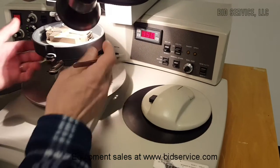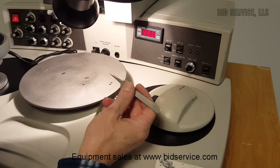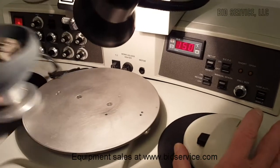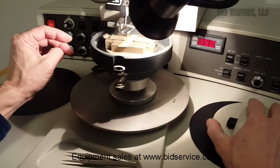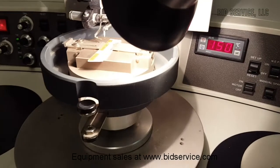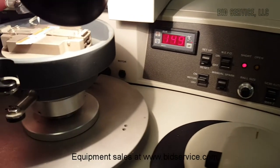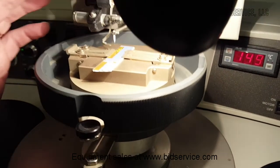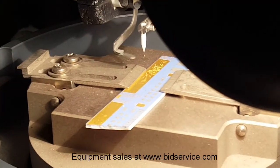I'll show you how to form a ball manually. I'm going to increase the tail size to 10 and then go ahead and do a bond. Now you can see that since the tail size is long — meaning the amount of wire left after the second bond — we get a short over here because the wand is hitting the wire. The EFO is indicating that we do have a short.